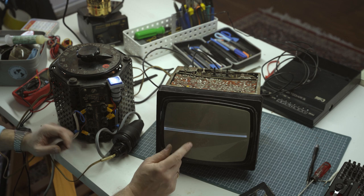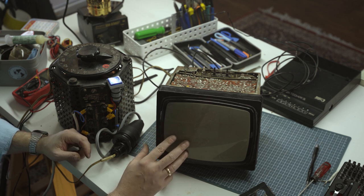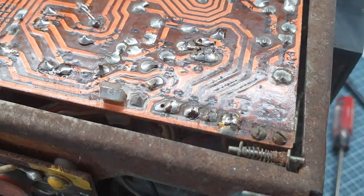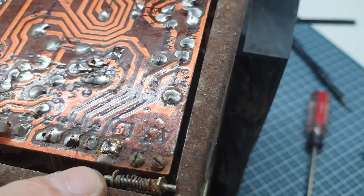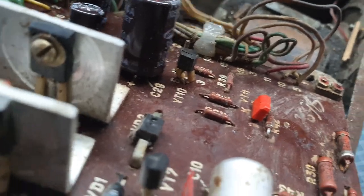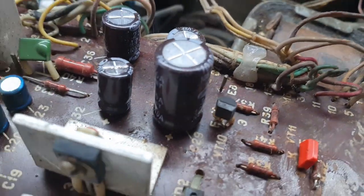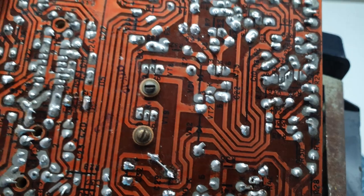We're still not getting good raster. I'm going to go back into that circuit. Here's the board with the vertical deflection — I'm noticing a broken solder joint, which is probably a ground. Cold solder joint on number five, which looks like it goes to the speakers — probably not super important, but if that one's broken, the others might be too. We're going to reflow that and check some continuity across this board — the problem is here somewhere.